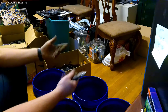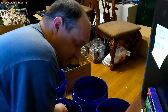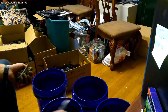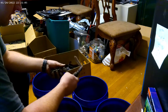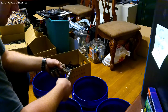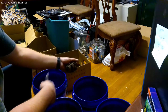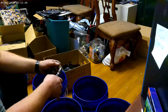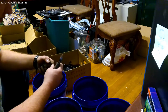You're sitting here watching me go through this stuff — it's super easy, it does take a little bit of time. I was quite concerned about this at first, but the lead ones: if you grab a hold of it and squeeze it, it's going to make a mark. You can just grab it by the edge and squeeze — whichever way, if it leaves a mark it's lead. If you squeeze it and it doesn't make a mark, it's zinc, because you're going to have to squeeze pretty hard to make a mark in zinc.